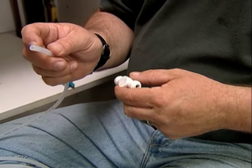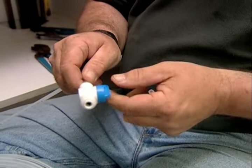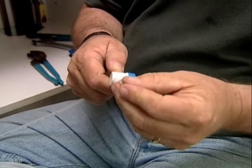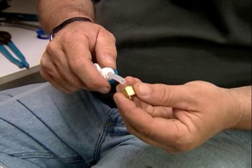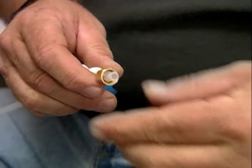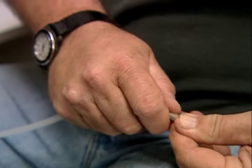Now to make the connection of the plastic pipe to the copper, I'm going to put a little in-line shutoff valve. This came with the filter - it's really handy for changing the cartridge. Here's the other half of that pipe, and the last connection is into our T-fitting. That's got a nut, a part called a ferrule - it's a little ring - and the last thing is an insert to support the inside of the pipe to make it nice and tight.